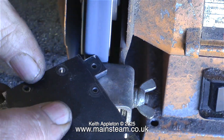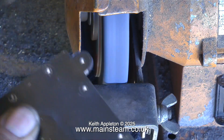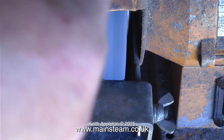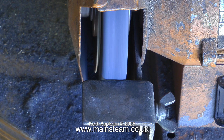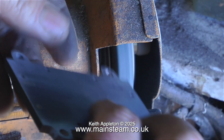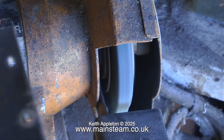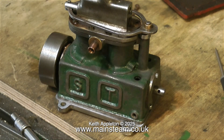As usual I'm not wearing gloves, and as usual the metal keeps getting quite hot so I put it in my pot of water to cool it down before I carry on. You can also see that the little grinding machine moves all over the place — that's because it's not fastened down, and that's a health and safety no-no. Grinding wheels should always be fastened down. Mine isn't because I need to move it around to accommodate different sizes, and that's very wrong, but it's only for the purposes of the video. I cannot recommend that anyone uses a grinding machine of any description — whether rotary or belt type — without it being bolted down securely to the bench.